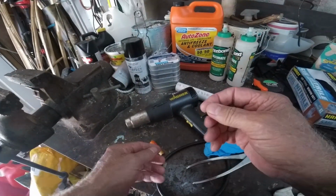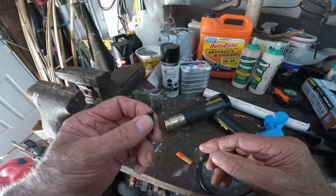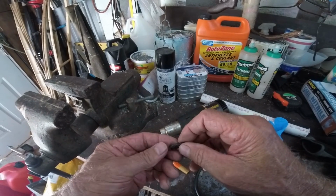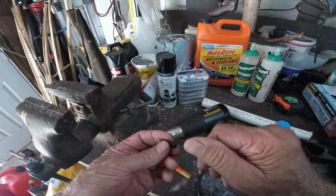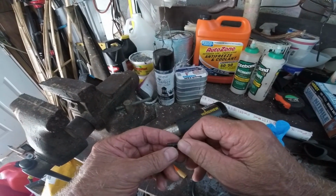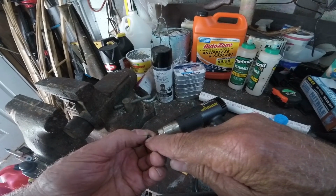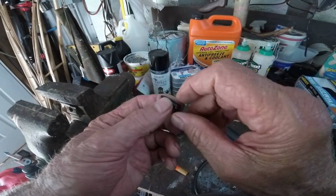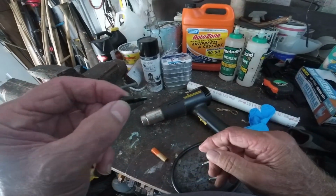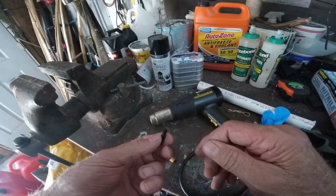are hardwood plugs. You get those down there too. They're in a different bin. They're dowels. They're small dowels. You get these. And all I do is I come over to my grinder and I buff these down, sand these down till they got a little taper to them. I do the same thing with the needle trick. I stick a needle right there. And then I spray paint them black. Spray paint these black, let it set, come back 24 hours. Now they're ready for epoxy.